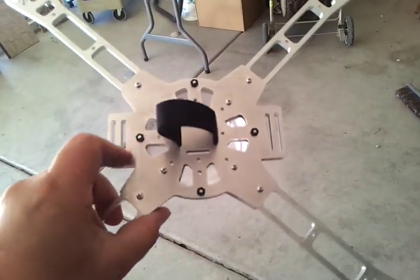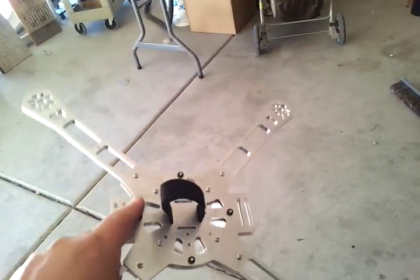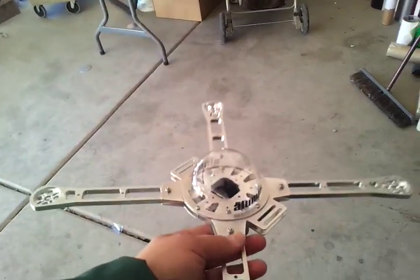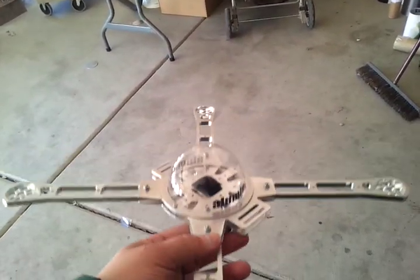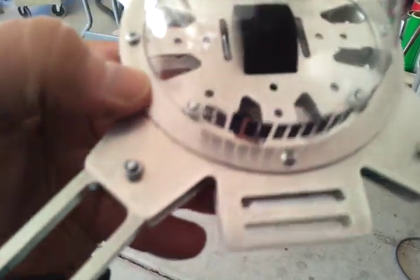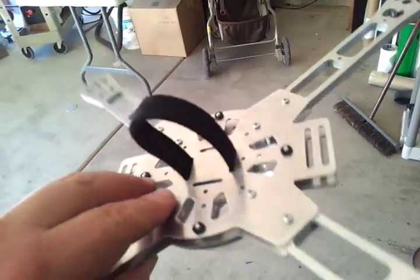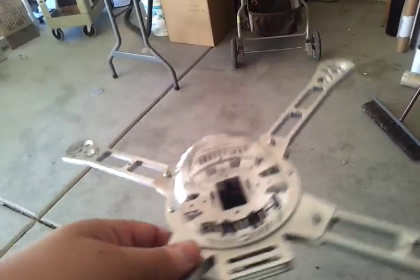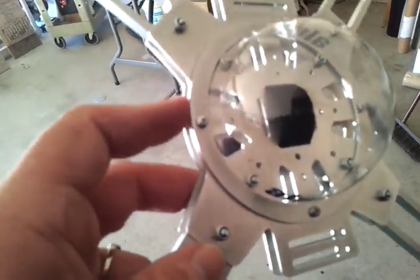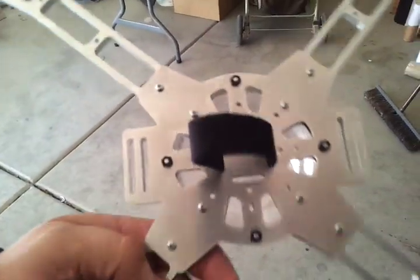You've got these accessory tabs here. I'm only going to put two on this frame, but if somebody wants a custom one with four, that's up to them. It's under 17 inches motor to motor, so you can run 8 inch and 10 inch props, and it's under 300 grams. It's only being held together with eight screws and eight nuts — four on the inside, four on the out. Then the four screws and nuts that hold the dome on use plastic nuts but metal screws. You can see how the design here is all conformed — it's a circle, so everything fits and flows right.